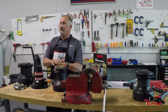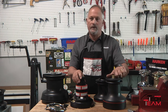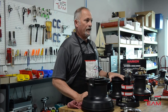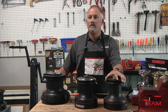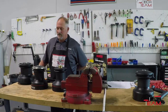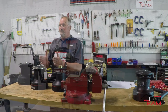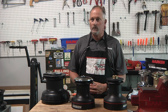The weight savings depends on the size of the winch. This is a 48 and this is a 50 — this winch weighs about 20 pounds and this winch weighs about 12 pounds. So six winches on a boat, that's a big savings of weight. In a lot of cases you can replace your winch with a new radial winch of a smaller size, because it's more efficient. We compared them to Lewmar winches in some cases and because of the architecture — we have a bigger center stem and we can get more bearings taking the load — and that translates to more efficiency.